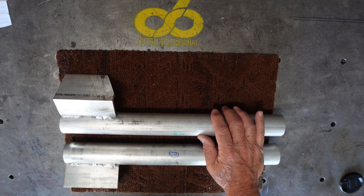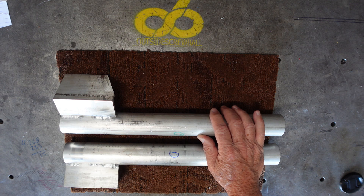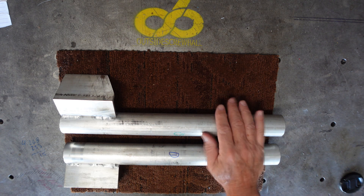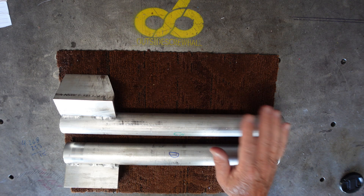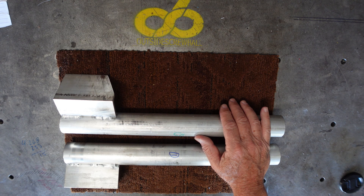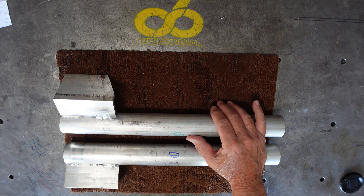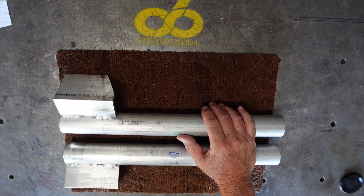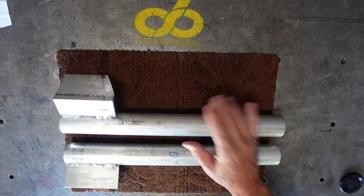Time to do a YouTube search. YouTube's always got it. I found a fellow with a Miller 250 and he described my condition right on the number. He said, yeah, you're probably a home shop guy with a Miller Syncrowave 250, probably feeding it with a 50-amp circuit. He said to run quarter-inch aluminum you're going to have to push that dial up to about 150 amps — 175 would really be good. That 50-amp circuit's not going to take it, and it did not.